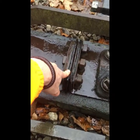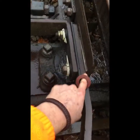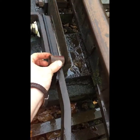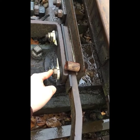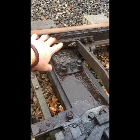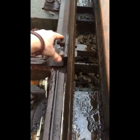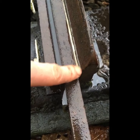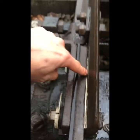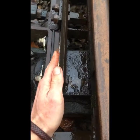We also have an insulated sole plate here. The insulations for these are ferrules. The ferrule sits inside, the bush sits on that, and then we have a metal washer and locking nuts. When you come to adjust these points in future, you are allowed to put a shim in. If you're going to put a shim in on that side, there's no problem — there's no insulations. You loosen the two bolts on the lock stretcher and drop a shim down. There's already a shim in here — that's an alignment plate.